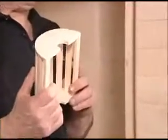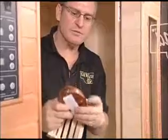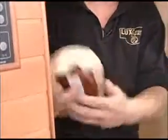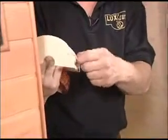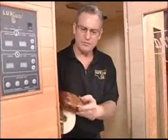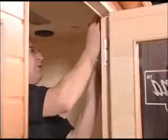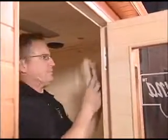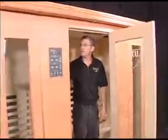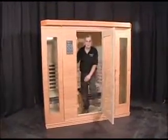Now this is the ionizer cover. You're going to have to make some adjustments — the switch on the ionizer is on the left-hand side for on and off. When this is in here, it's hard to get your finger in there to turn it on and off. So what you can do is take a hacksaw blade, cut this piece of wood in half — two pin nails hold it in there and you can bend them right out — and you've got plenty of room for your fingers to turn the ionizer on and off. There's a red light on your ionizer that will turn on, meaning it's running. You're going to screw the cover right to your wall. That's it for the assembly. You're going to have independent light switches for your exterior and interior lights inside your right-hand side of the sauna, if you choose to sit in the dark or the light.